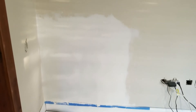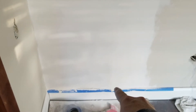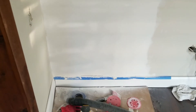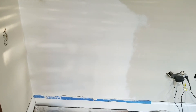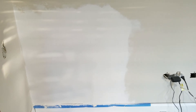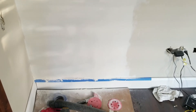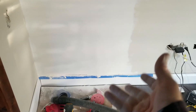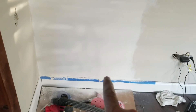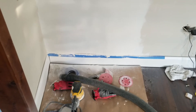There it is all sanded down after our third coat and ready for paint — looking pretty flat. There's just maybe the teeniest slightest little bit right along there. Some of the better drywall guys out there like Paul Peck — if you haven't been to his YouTube channel, go check it out; he's got the best information for guys that want to up their game in drywall mudding and taping. Those guys can get it done easily in three coats. You could leave it like this, or you could do one extra coat there using a 12 inch taping knife, or even 14 might be better too.